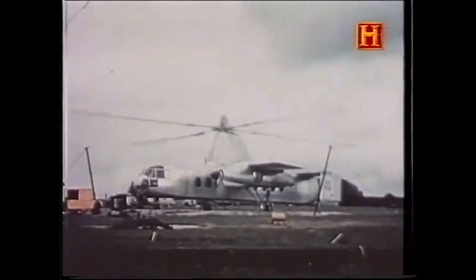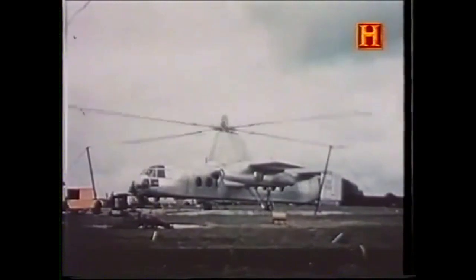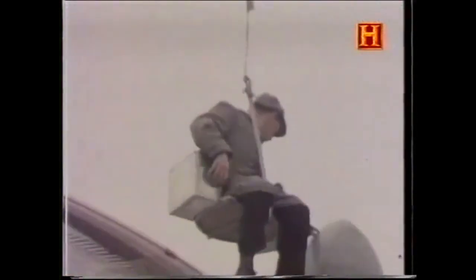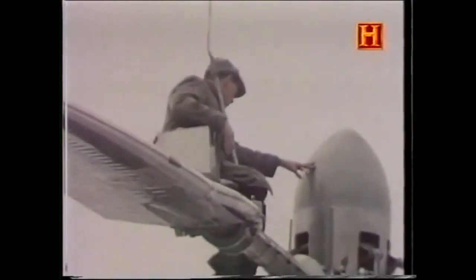There is still another very great problem that the helicopter had to face, and this was a subject called ground resonance. It is a situation where the body — the airframe on the ground resting on its undercarriage, which is also an elastic entity — and the rotor rotating with blades that were also elastic members. As the blades oscillated in the plane of rotation, you could get a situation where the effective mass of the rotating system moved offset from the axis of rotation.